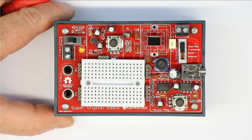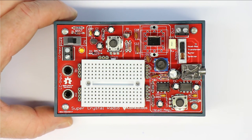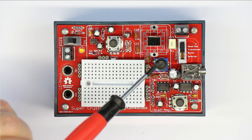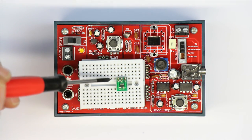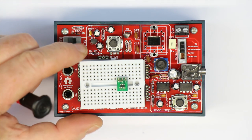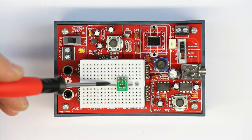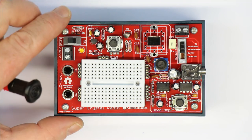And we found that we got between 40 and 60 dB better results than with a standard crystal radio just by the use of this transformer, this little DC impedance matching trimmer, and by using a super low reverse current Schottky diode from HP, nowadays Avago, I don't know how exactly they pronounce it. So, and that is not all.